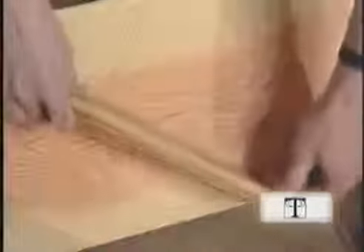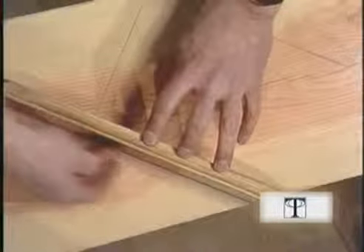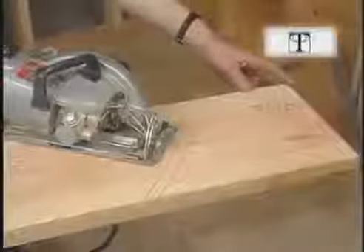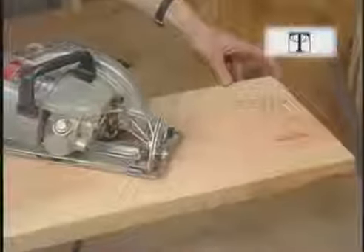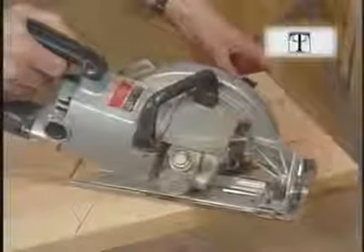If we had planned on using three-quarter inch oak flooring and had adjusted for this in our total rise calculations, I would want to add the thickness of this flooring to the bottom of my carriage, and this new line would represent our subfloor. I'm using a Skil worm drive saw — the same saw I use for all my framing — only here I put on a 42 carbide blade to get a smooth cut.